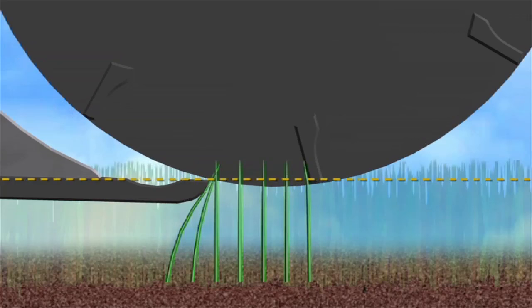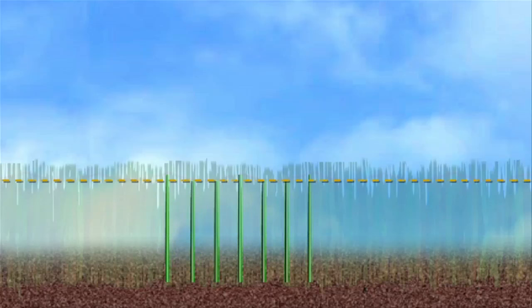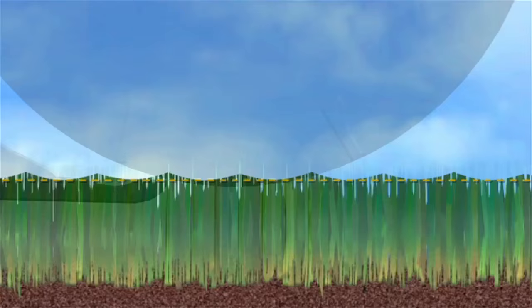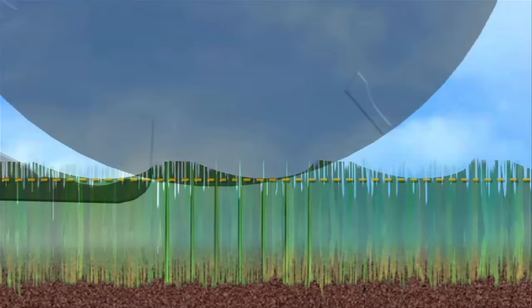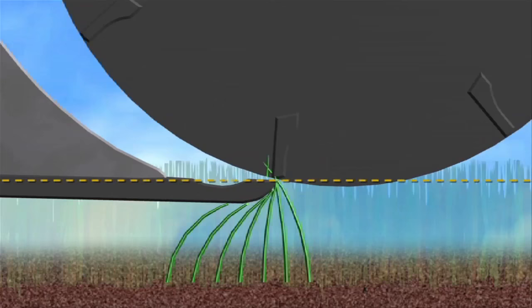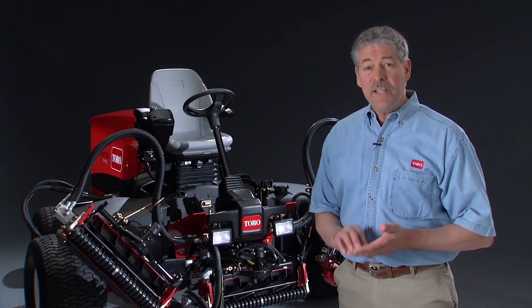Contrary to popular belief, running the reels at full speed regardless of ground speed or height of cut is not equivalent to double cutting or double clip. During the reel mowing process, the bed knife pushes the grass forward and the reel blade acts as a rake to gather the grass up and back toward the bed knife. Optimum clip rate is achieved when both sides create small, even gatherings that are then cut, resulting in a small unnoticeable scallop and an even aftercut appearance. If the reel speed is set too low relative to the ground speed, there is too much space between cuts, resulting in visible clip marks and uncut grass. If the reel speed is set too high, you risk leaf tissue damage or burning of the turf due to increased blade impacts prior to cutting, which affects the long-term health of the turf and susceptibility to disease.